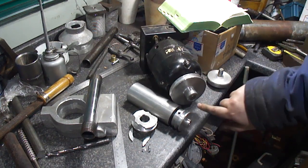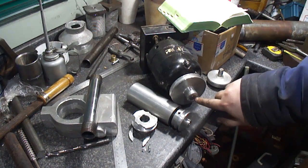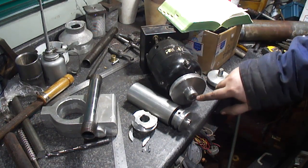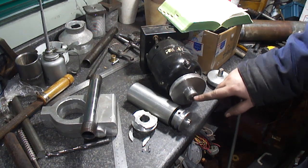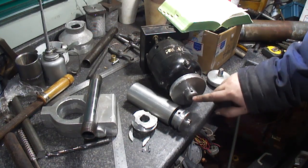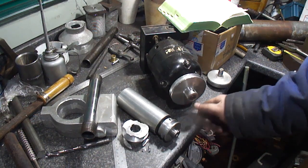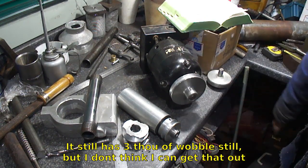So what I did, I just bored it out to 3/4-inch and put a 3/4 inch piece of steel in it with some red Loctite, pressed it in, used a hacksaw to cut grooves, or notches, all along it in different spots, just so the red Loctite had something to key into, and just pressed it in, and then bored it out, and drilled through all of it, put a 5/16 inch set screw to lock it on the shaft, and that thing's never coming off. Reboard the bushing there so I don't have to worry about the thing going bad anymore.